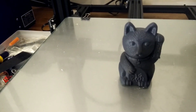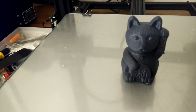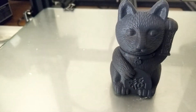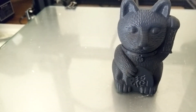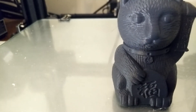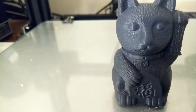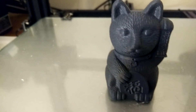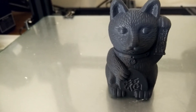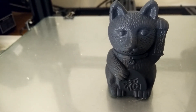We just need to wait for the bed to cool down because this is absolutely stuck fast — the bed is currently 56 degrees. From this distance the cat looks pretty good. There's a little bit of layer shifting going on just above the nose, possibly because of the filament jam I discussed. The problem is just under the mouth where the filament did actually jam, but the quality looks pretty good. This is actually the STL off the website, re-g-coded via Simplify3D.